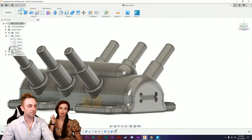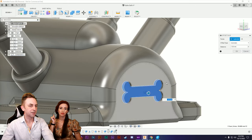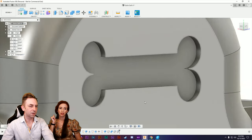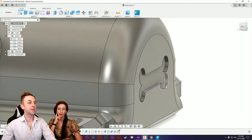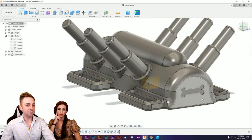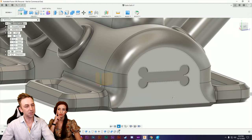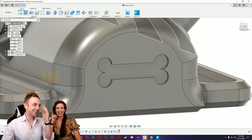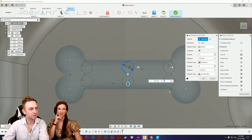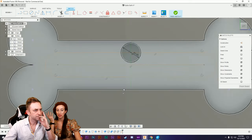It was leaving at 1 millimeter. So if we check to here, okay. Minimum distance, 0.5 millimeters. Great. I think if we were to make those vents, they should probably have little holes in them or something. But right now, here we go, folks. That doesn't look great, though. So perhaps it is not necessary for this design.